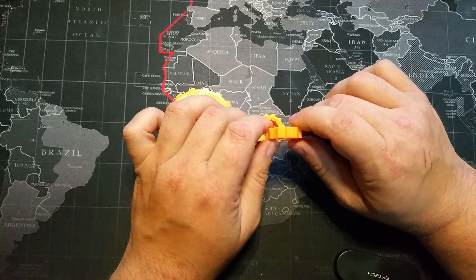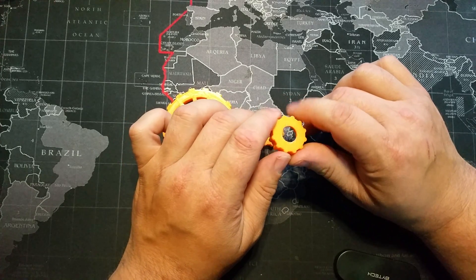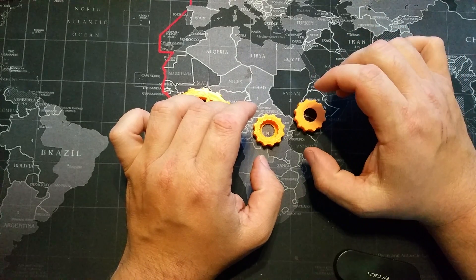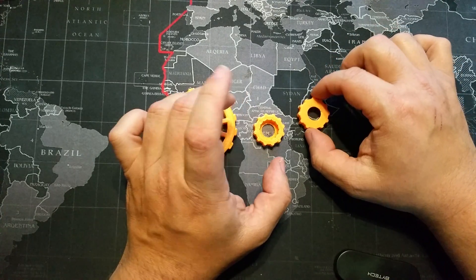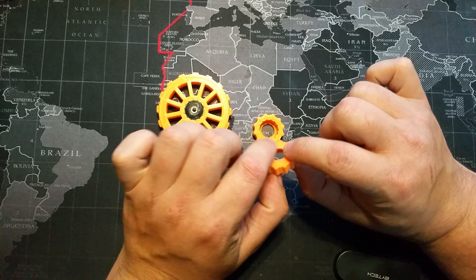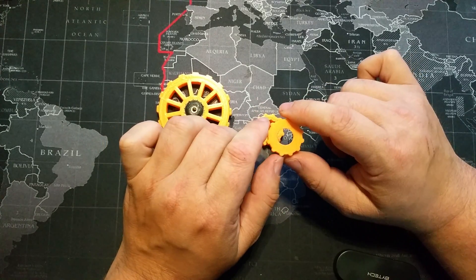This is the original one I tried. This is by Bowkicks, thing number 2350483. There's nothing wrong with these, it's just they don't do what I want them to do. They're too small — even these are too small — and they're too hard to turn. I still have to reach in there with two fingers and manhandle these. One of the biggest problems is the knob sits flush, so this knob edge and the entire surface area are in contact with the Y carriage plate, which increases the amount of friction. So they're actually harder to turn even though they're larger.